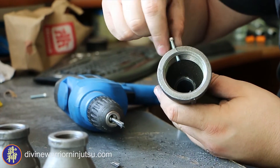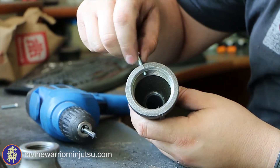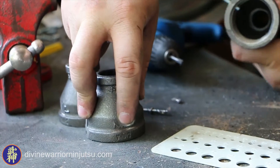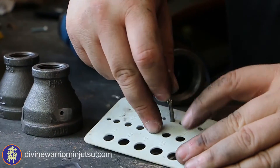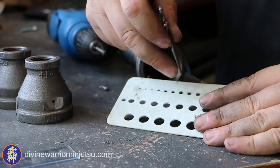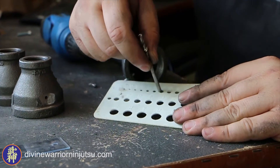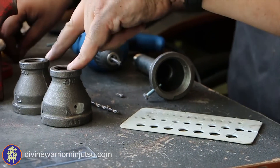And there's our bolt. It feels a little loose to me, but once we tighten it against our piece in the center, it should be fine. Worst case scenario, we could always wrap the bolts in Teflon tape just to make them snug. I only did one to make sure — now I'm going to drill all four holes again with the 11/64th drill bit. Actually, it fits into 5/32 too — quite snug. So 5/32 might work; 11/64th, 5/32nd, and then re-tap. Hopefully I can do the rest without having to buy a new tap.